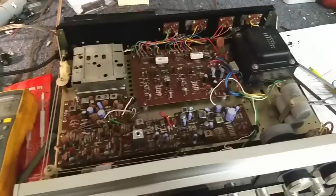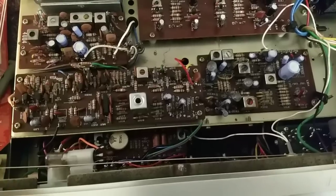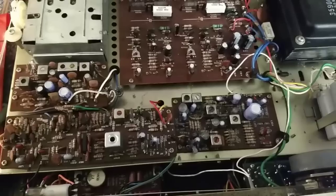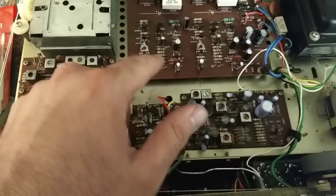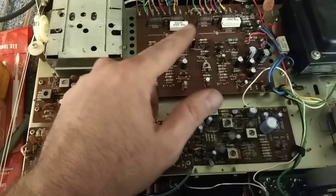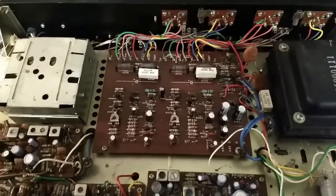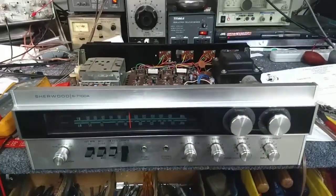Nothing really else that we need to do to it. The reason why this one was difficult to troubleshoot was because it uses a single stage pre-amplifier - there's no buffering. So any kind of load will pull down that circuit, and that's why it was showing up so far back as the volume control discrepancy. When in fact what was wrong was not that one channel was weak - it's that the other was too strong. The reason it was strong was because the capacitor to the input, which also connects to the feedback loop, was shorted. It was pulling the input down, and at the same time pulling down the feedback loop causing more gain, more volume - that's why one channel was louder than the other. Kind of weird. So this thing's good. Thanks for watching guys, more stuff to come.